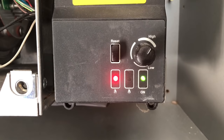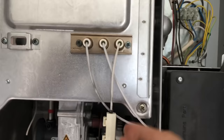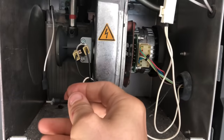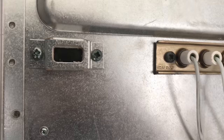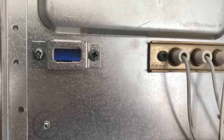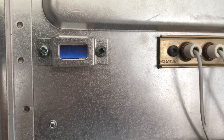Looking at the boiler itself, we've got three probes. The first two — left and right — are the ignition probes that spark between each other to light the gas. The third one is a flame rectification device that goes off to the PCB to tell the boiler the gas has been lit. On this one it's interrupted by the condense trap. So the first thing I'm going to do is disconnect that, reset the boiler, and try again — ruling out one thing at a time. When we light the boiler now, the flame comes on and stays on. By simply unplugging that cable, we've identified the fault as being on the condense trap.